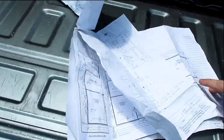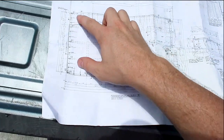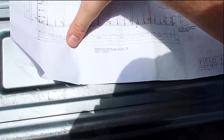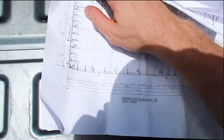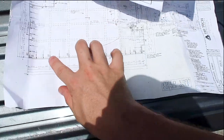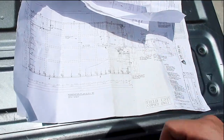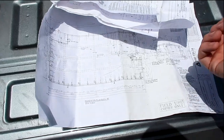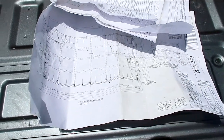Whenever you're looking at these plans, you want to make sure you count your post tension cables — you can see your live and your dead ends here. You're going to count your live ends and then count your post tension cables to make sure they're all there. You can also count your pads and make sure the plans match exactly. The hard part is mainly figuring out how deep they want the beams and the thickness of the slab.